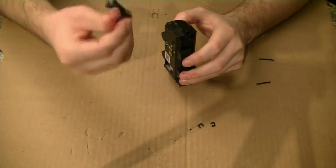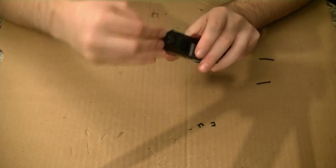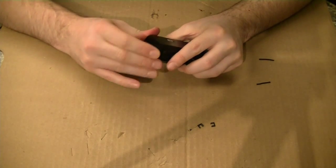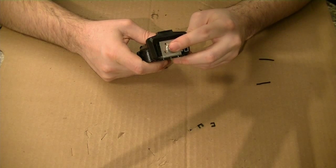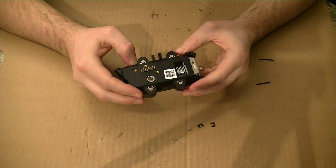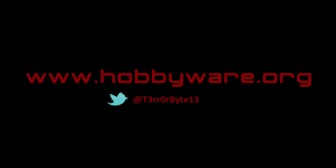The last piece goes on here — make sure there's a little hole here and a little peg here, so you want to put the hole on the peg and slide it into place. Once you've got it reassembled, check that there's some bounce in it. If not, you need to take it apart and redo it. Otherwise, that's how you clear a filament jam out of your MakerBot extruder.